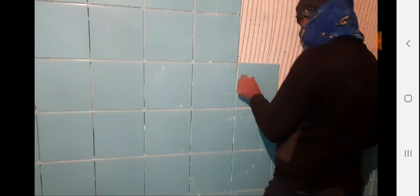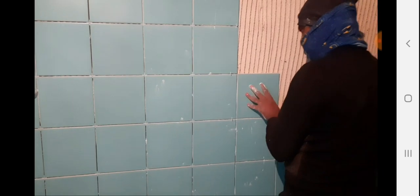So we'll let you know as we complete this whole toilet with you, and we show you the other things. Like this, and you see here, in the joints we put the spacer, 2 mm, as we require a 2 mm gap. And sometimes we put it like this to hold the tile. This is the electrical opening, this is the plumbing opening. This is the same process, continuing all the time.